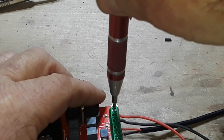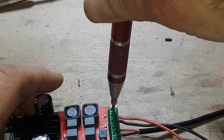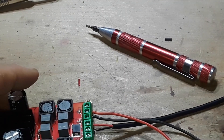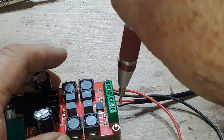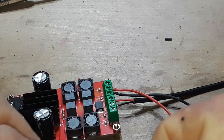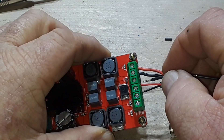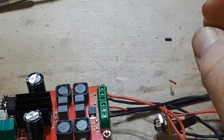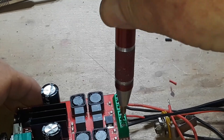Thank heaven there's a little bit printed on the circuit board, and I'll show you the ad where I ordered this from — it did have a little diagram. I was looking at the datasheet for the Texas Instruments TPA3116D2, and it is a really sophisticated little IC that can be set up to do a bunch of different things. For instance, it has AM radio rejection that can be adjusted through switching frequencies, and that's set with resistors. But this is set as it's set, and you get what you get.